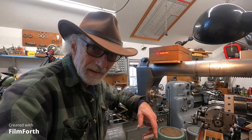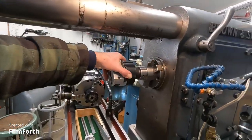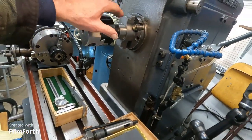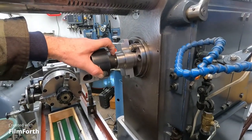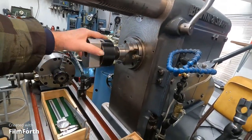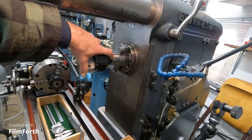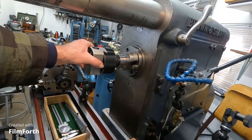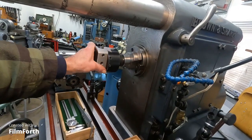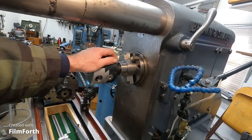It was kind of warm yesterday but it's frosty today. I've got that adapter I was grinding stones on in the spindle here and it's running a thousandth and a half on a four morse taper. I stuck a four inch boring head in there and it'll work fine. This holder has a set screw so I'll grind a flat to help secure the morse taper into that if you use it for boring — it's kind of a nice setup. Poking around on eBay, you can't get by much under a hundred bucks adapting a boring head.